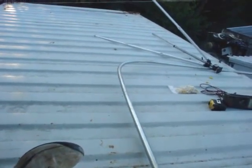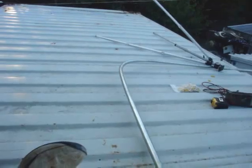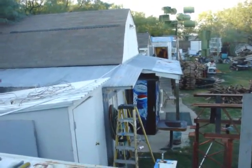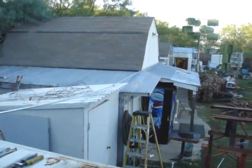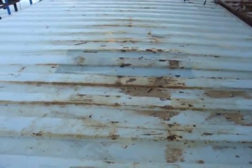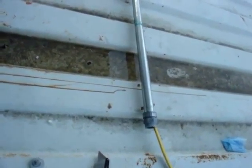I'll grab them once I get all this done. I took a bicycle wheel, stuck it in the middle of the conduit run, and placed it between two of the rungs on a trailer, then pulled the conduit around the inside of the wheel — it made a nice curve since we didn't have the benders handy. The wire is already pushed all the way through, going about another ten feet past the awning. We've got most of it installed up to here. All I've gotta do is put a junction box here, another junction box right here, and continue on to the next one. Anyway, bye for now — many good things to you and yours, hasta luego.